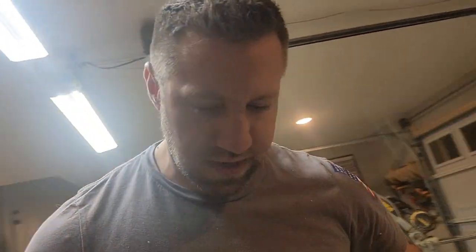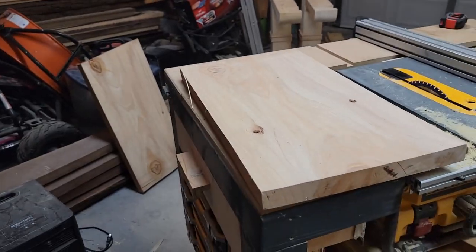You saw that big long process of cutting, cutting, cutting some more - but now we've got eight of each piece. Four sides times two, so I got them in stacks. Now I'm going to go ahead and cut the pieces for my trim - my corners, my side pieces. I'll use two pieces of cypress I've got here. They're a little wobbly but it's okay. I'm going to rip these down to three-quarter inch wide strips, and we will use the push stick for this.